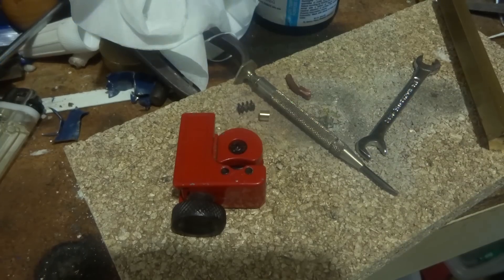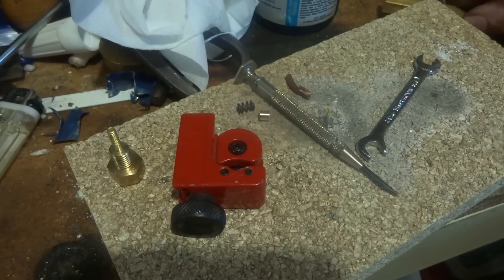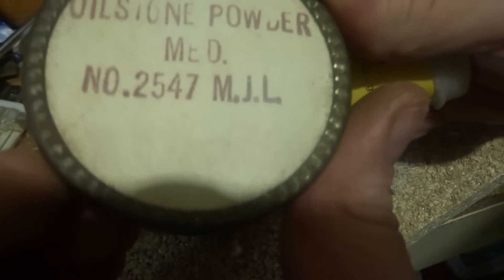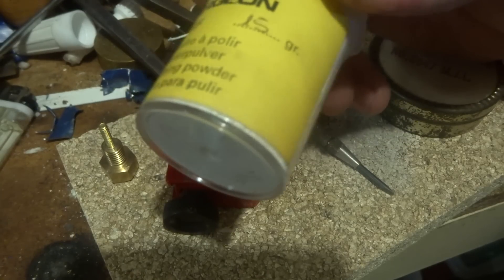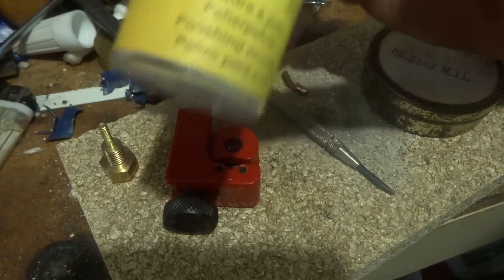The book says we should lap this to fit with a bit of brass. I haven't got any brass, but I do have some watchmakers diamantine, which is the next best thing — probably a bit more abrasive. So what we've got is some medium oil stone powder and some diamantine polishing powder. This tin is reasonably new — it was bought brand new in the 90s and was pretty hard to find then, and I've used probably half a teaspoon off the top of it.